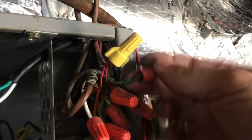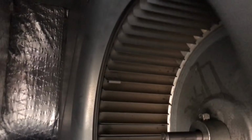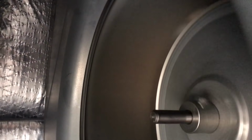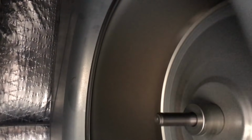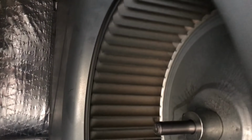So I'm going to take the red and the green wire nuts loose. And I'm just going to touch those two together while we watch the motor test its direction, and it'll test for resistance, I guess, and it'll figure out which way is which. Yep, so it started. Now it's going to stop. And then it's going to run the other way,